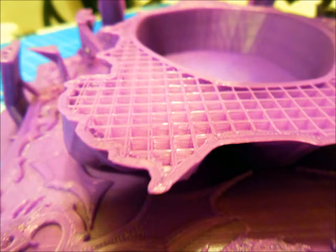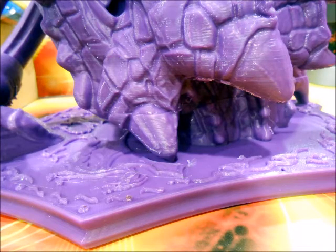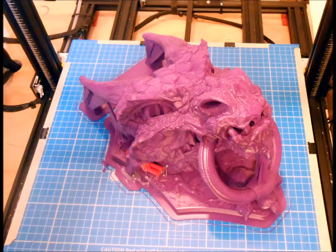Here's a cross-section of the model as it was printing, where you can see I was just off a hair. On one axis it appears accurate, and on the other it does not. The model is slightly rotated on the bed, so it's not a pure 90 degrees, which likely played into the optical illusion. The layer shifting, as you can see in these subsequent photos, really isn't horrible. It saved me another 18 hours of printing and, more importantly, filament — because this print used just about the entire spool, and restarting would have required a filament change.